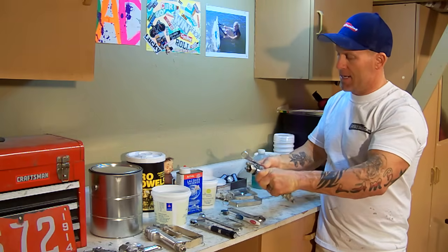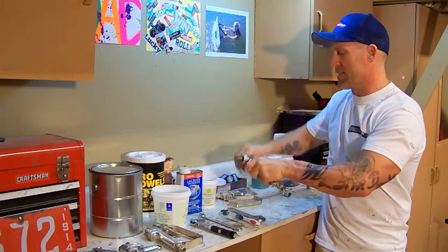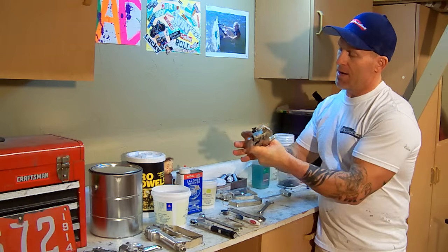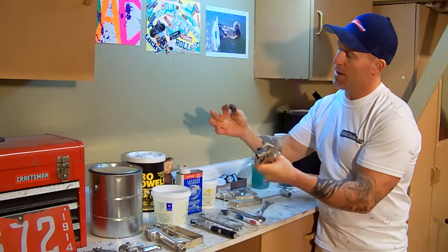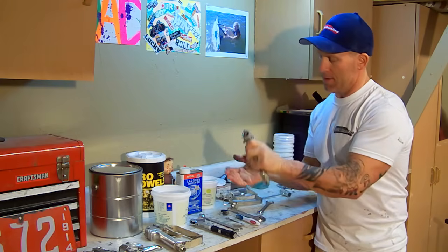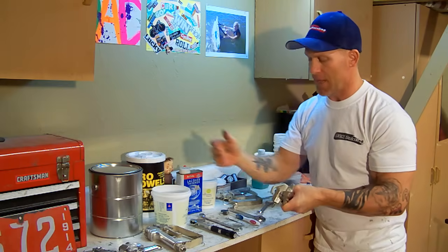So I'm going to begin taking the back side of the gun off now, continuing to use my 5/8" box wrench. Now we got both ends of the gun. When you take this end of the gun off, you're going to have a spring. Then you have one other part that goes on the end of the spring. You just dump that into your bucket.